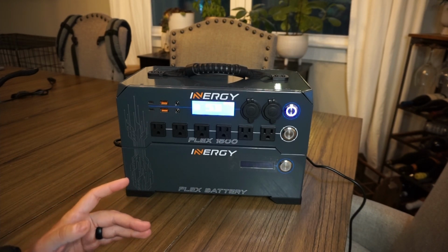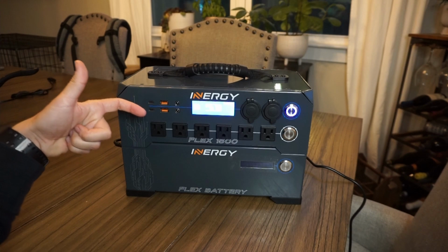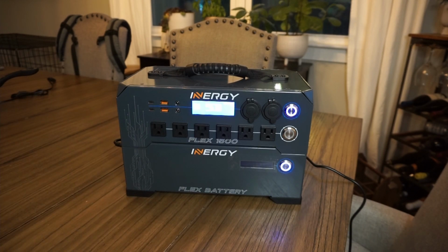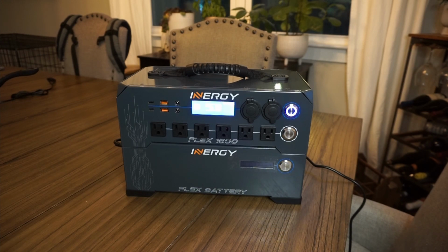Depending on what size television, potentially as many as or as few as 110 watts, so between 30 and 36 hours. Laptops, mine did run right at 50 watts from the wall charger. However, once again, it uses 6 watts to just run the inverter, so closer to 56 watts total. So according to the website, as many as 46 charges. I'm just going straight off of the 1,069 watt hours via one Flex battery, so saying 18 hours of continuous use, however many charges that takes. It will differ between the laptop being on or off. So similar to a refrigerator or freezer running on and off to keep the temperature at the setting that you selected for your freezer. We said phone at 10 watts would give you 100 hours of charge time.